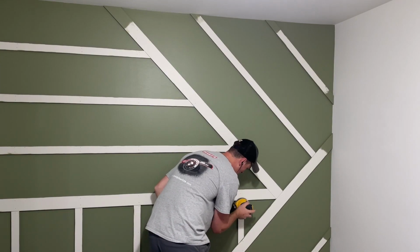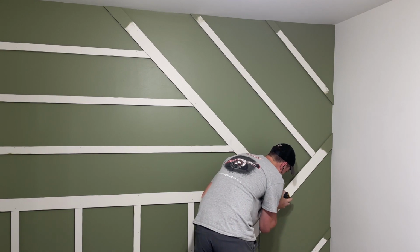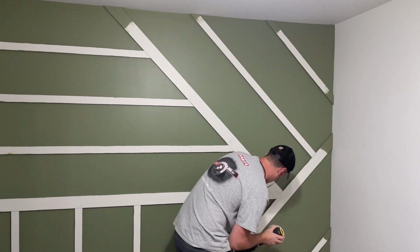You can see how good the 1/2 inch MDF really sucks to the wall when you nail it, and I didn't even have to go through and caulk the edges at all. So really there's very minimal damage done to the wall for when this fad dies and someone wants to remove this in the future, unlike those ceiling tiles at the beginning.